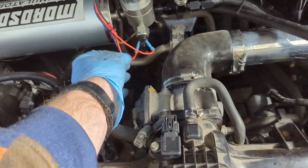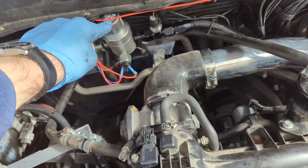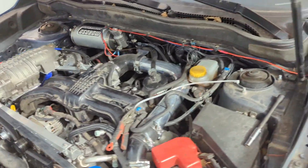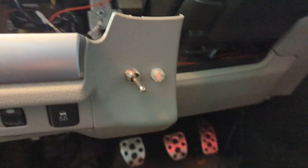On the way out you see there are two wires. One of them goes to power the valve, but then the other wire just sends that 12 volts back into the cabin, and we'll have a light that turns on to tell us the AccuSump system is working.